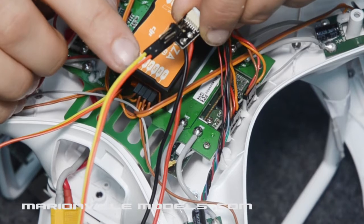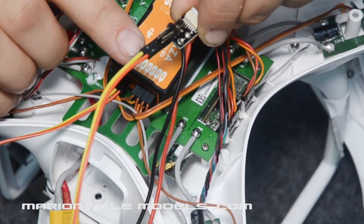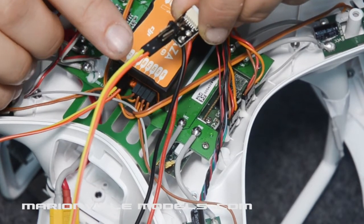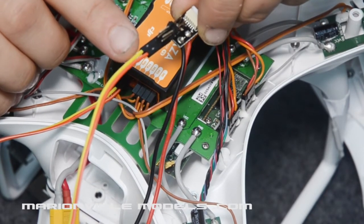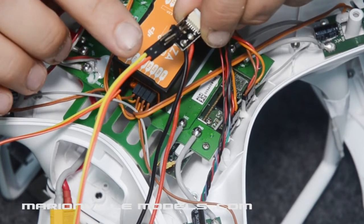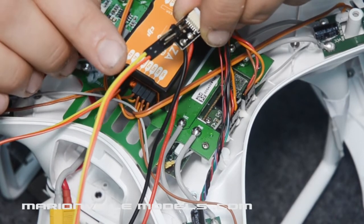If you plug the second cable in, the orange one, this allows you to make independent control over the roll axis. Now, you won't have actual control over the roll while you fly. However, if for any reason the gimbal doesn't sit entirely level, you can use the roll axis to do very, very fine trimming of it. So if we put the two on there.